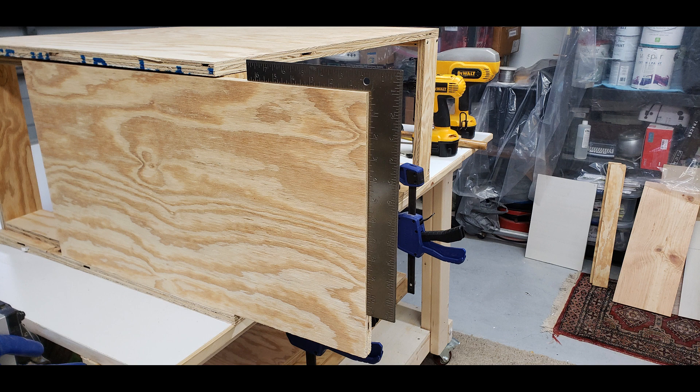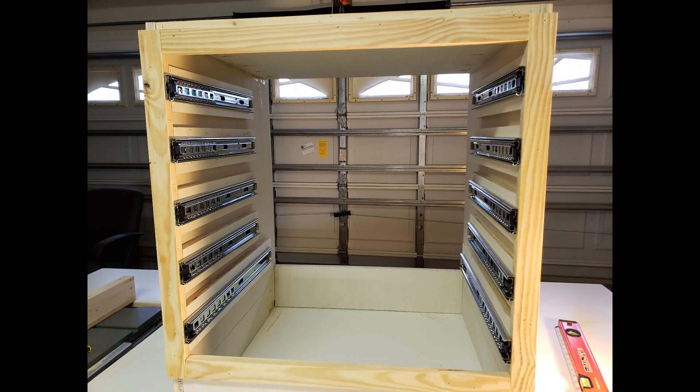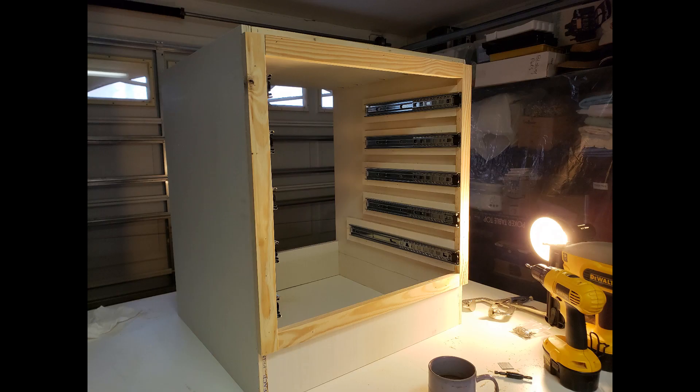This cabinet has five drawers with one quarter inch between them, so I didn't face between the drawers, only around the outer raw edges. Make the drawer facing from one inch by two inch lumber so the width is one and a half inches, or two widths of plywood. This makes the outer side edges of the facing flush with the outer sides of the cabinet, so the facing will extend three quarter inch past all interior edges. For the drawers to slide past this overhang you must build out that portion of the inside wall where the slide will attach.